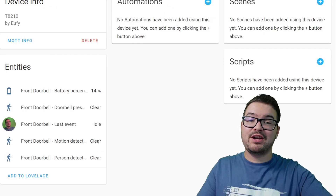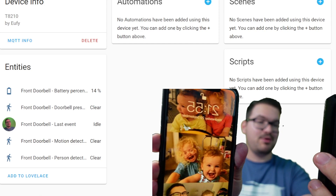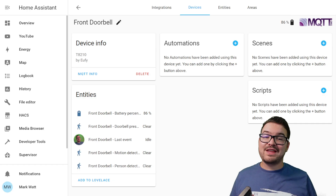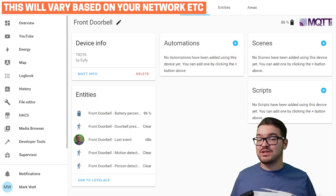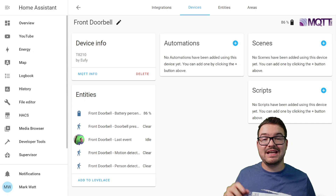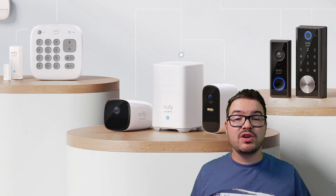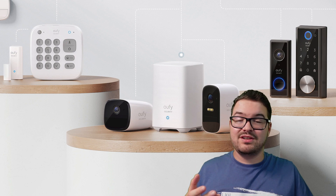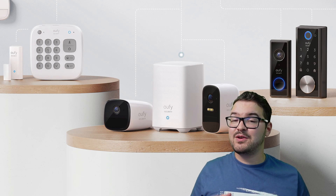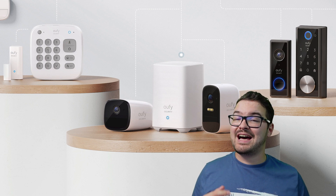As another quick test, I'm going to pick up the camera and also my phone — I've got no notifications on there. Waiting for the camera to detect me as a person... that's changed on there, and there's the phone notification. You can see that the person detection within the add-on was actually quicker than the phone notification coming through. And for eagle-eyed viewers, you may have noticed the battery level updated then too — it seems the battery level also changes when another event happens. So that was a quick look at the MQTT bridge. If you're not bothered about live feeds and those sensors give you enough information — like knowing when the doorbell's been pressed to trigger an automation — then this add-on is definitely worth a look.